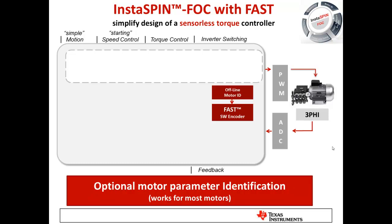We offer the capability to identify the parameters of the motor using a very short offline test. For a synchronous motor, this is simply the stator resistance, inductance, and machine flux. For an induction motor, we add the magnetizing current and the rotor resistance. Based on these identified parameters, we can set up our software observer to give good estimates of the machine's rotor flux, angle, speed, and torque.